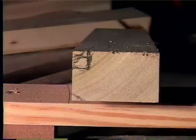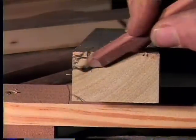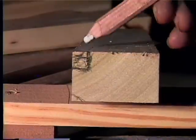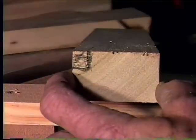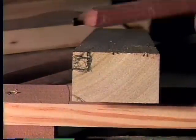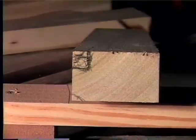All right, you've determined your glass size. We're coming down a 1/2. We're going out a 1/2. So we're really going to be just cutting out this 1/2 inch piece. Now we're going to do this. What we're doing right here is what we're going to do with all 4 pieces. We're going to run this edge very first thing. Don't do anything else until you do this first.